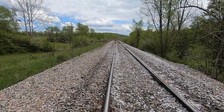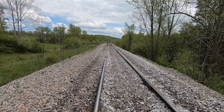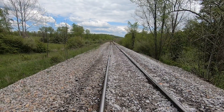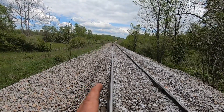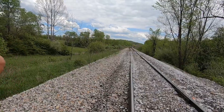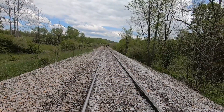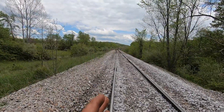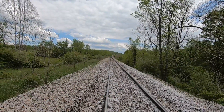Good morning, we're here on curve 30, actually a tangent out of curve 30 — that's 30 down there. We're at about milepost 7.8. I've got a little problem here with this track. The north side rail is low, and we've got a cross level deviation in relation to the south rail. Also, this track is sliding, so I'm going to have to go back and come out of the curve and plot this.